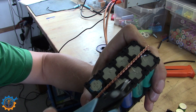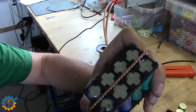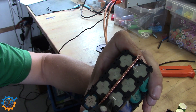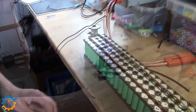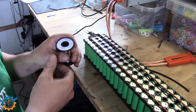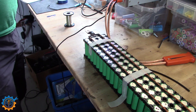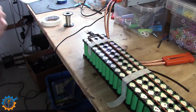It's important to understand that all cells behave a little bit differently. For instance the blue ones I have here as an example - they are a lot harder to weld and they will come loose rather easily if you do not weld with a little bit more power. Meanwhile the ones here sit firmly without a problem at all. So it's just a matter of actually soldering the busbar now. What you see here is actually one of my batteries and I'm going to show you a little bit when I do the spot welding on this battery here. I just take some tape around it, which will of course need to be removed later on, but it keeps the stuff in place while I do the spot welding.